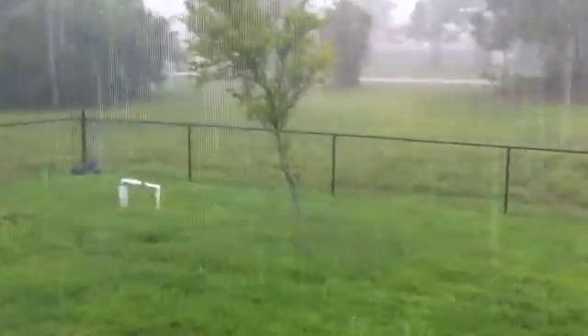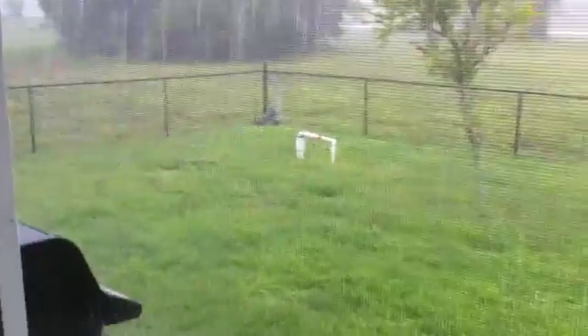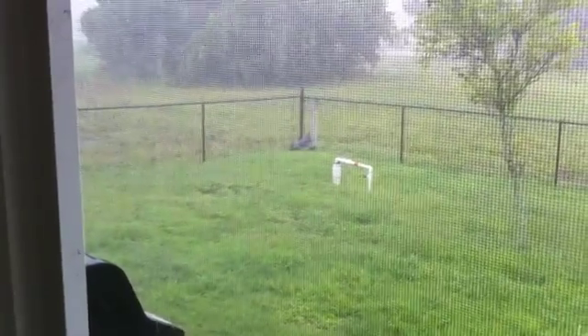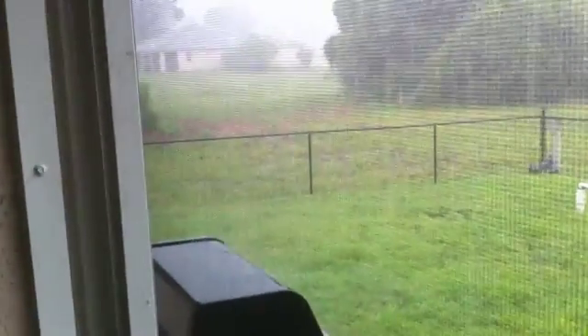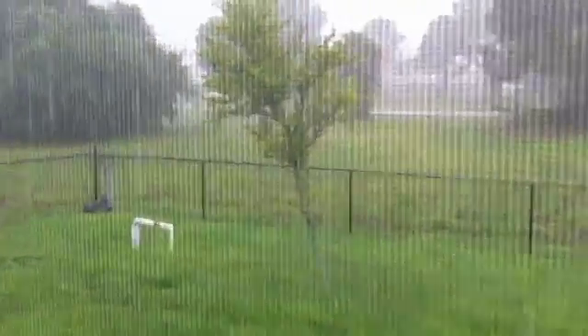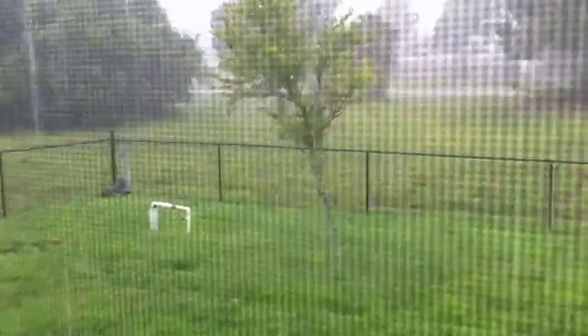I shifted it back 22 feet. I'm sitting in the truck right now — just doing this as a joke with the rain thing. It looks like a hurricane with the trees going up and down. Rain came just a little bit, so I ran fast and got a contractor's trash bag and threw the coax in it — you can see it sitting over there in the corner of the fence. Wrapped electrical tape around it so it wouldn't see any water in the other end. I had the balun above that fence post in the center of the picture, but since the back tree is higher, I shifted it and now it's above that fence.